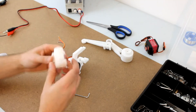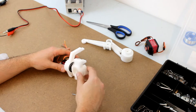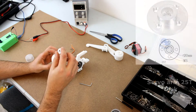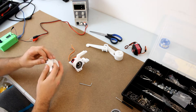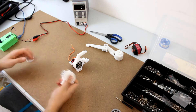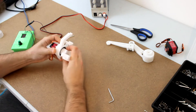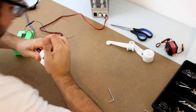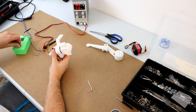By the way, I left the list of components to build this robot in the description of the video. This second PLA piece is going to be attached to the servo motor shaft and rotate. First we attach an aluminum disc to the PLA piece using two screws, then press the two pieces together until the servo motor shaft is completely fixed. This joint is further secured with a screw through the servo motor shaft. The first joint works!